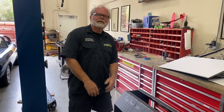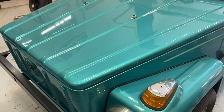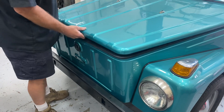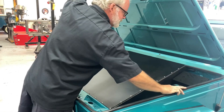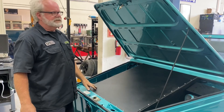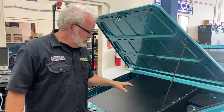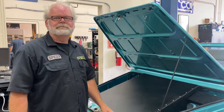How could somebody use this for their own EV build? Open the hood, open the trunk, look behind the seat — figure out where you want to put a box and build a foam mock-up. What you see here under the car is not a foam box — this is the product after the foam box, because the foam box proved it would fit. Then we copied the foam box in aluminum, welded it together, put in the batteries, and installed it in the body.